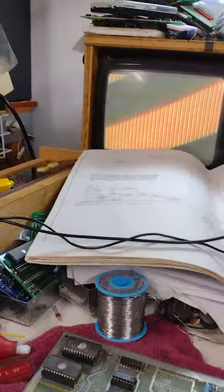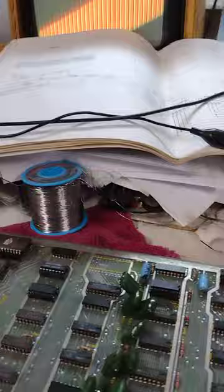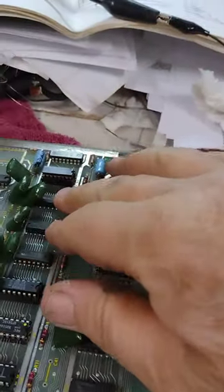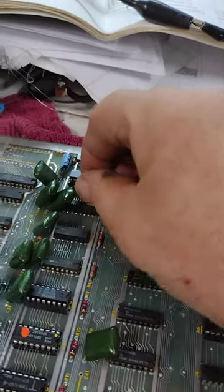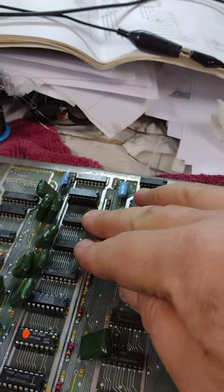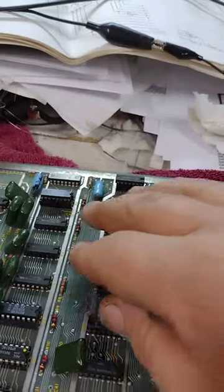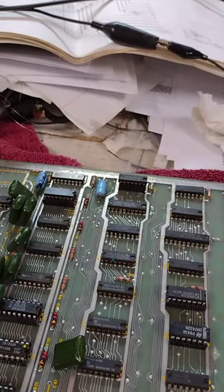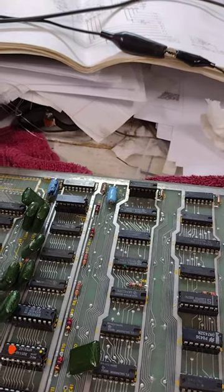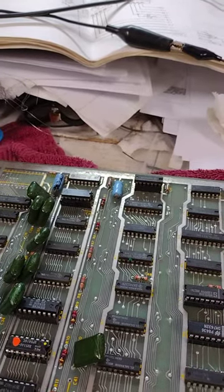Now the self-test is reporting RAM errors — it's giving me RAM errors for these two RAMs here. The next thing I'll do is chop these out and replace them with sockets. But before I do that, I'm going to probe and see what the pin 14 outputs look like. Those are the outputs for these chips. If they're not doing full swings then yes, those RAMs are definitely bad. If they are, there might be a logic problem causing the errors, so I'll probe before I blindly replace them.